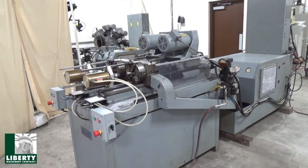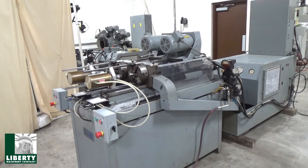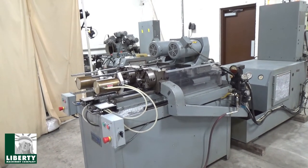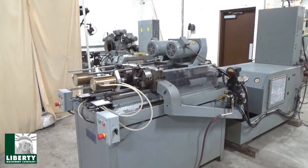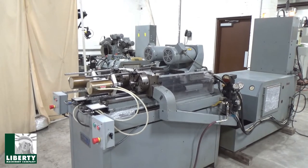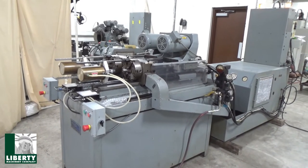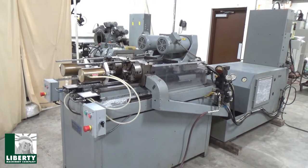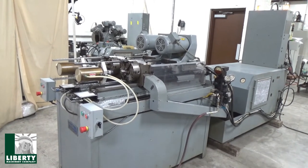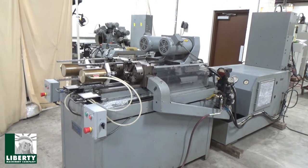This is the 3-quarter inch by 15 inch stroke Eldorado M751061, a two-spindle gun drilling machine with a G&G Technical retrofit in 2014. The retrofit consisted of adding a TRIO motion controller with TRIO HMI touchscreen interface. The controller allows for adjustable home positioning, teachable zero start point with programmable part depth, and three each of the following programmable speeds, all per part program.